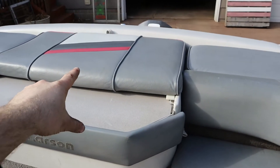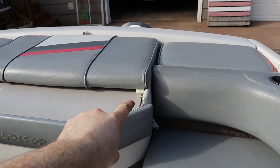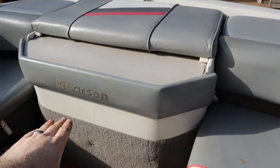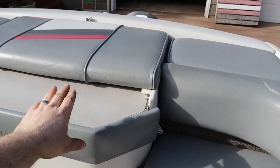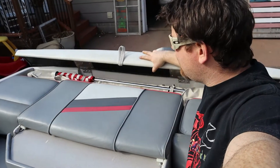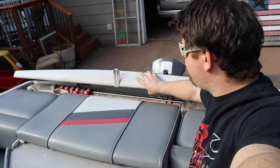What happened was I had to push this cushion back, and that's why you can see that bracket there. I'm going to put a piece of wood and either paint it white or stain it to match the floor, and then those brackets will be hidden. This slides out into a table anyway, so it didn't mess with any of the functionality. The reason I had to do that was because with this pushed all the way back, there was a lip back here that this cover lifts up and sat on, causing the cover to sit extremely high. These covers right here where there's storage weren't sitting flush anymore, which would cause this panel back here to warp whenever you'd step on it — which is a problem because you're constantly in and out of the boat when you are skiing or wakeboarding.